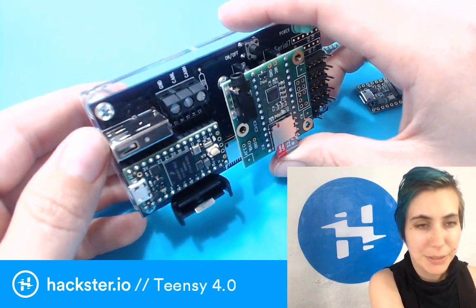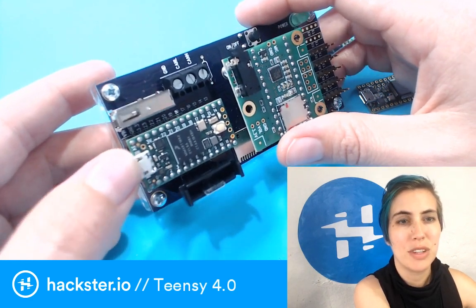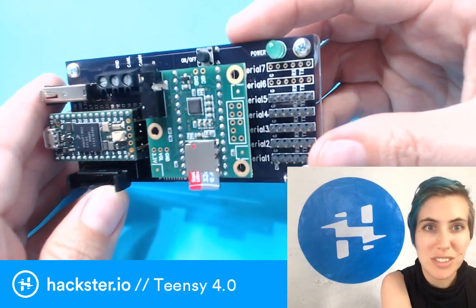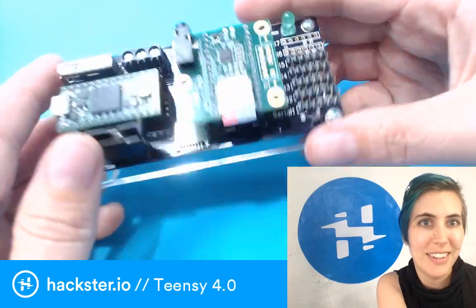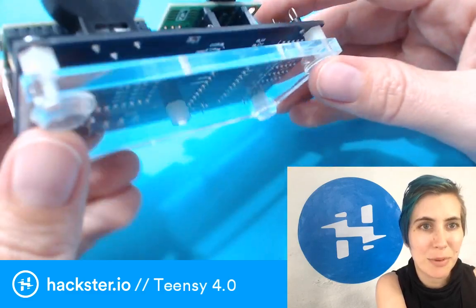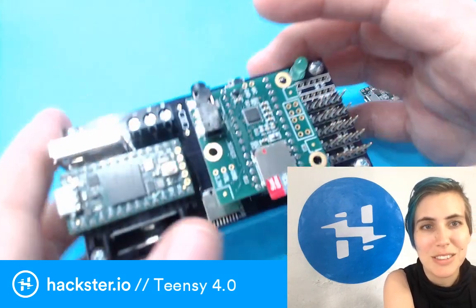It has a USB port, which I assume would be for a peripheral device, and then one that's the host port, and one that's the client port — where one becomes the peripheral to your computer versus the other where you're hooking up another peripheral to your Teensy. Over here you've got your CAN bus breakouts, and then over here you've got a bunch of seven different serial outs, which is ridiculous. You've got a little power light, you have the on-off button connected to that on-off pin we talked about earlier. This is your whole dev board for it, and it's clearly made by OSHPark — you've got the beautiful purple color and that beautiful gold plating on the white silk screen, which is so familiar.